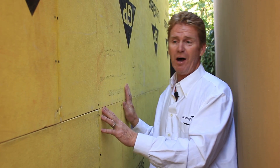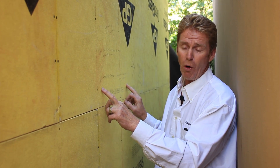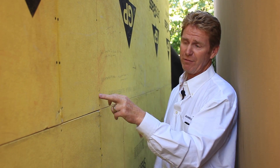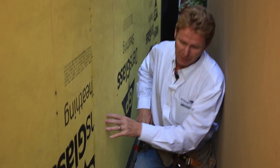This DENS glass board is over-sheeting. On the other side of this there's a plywood back and this is 5/8. When homeowners ask me why they have this, I say if it's on the specifications — meaning the prints and the architect spec it out — then you better put it on. There's a reason for it. It could be that we're close to the garage here and it has a little bit of fire rating value.